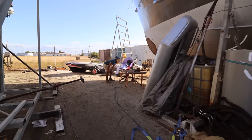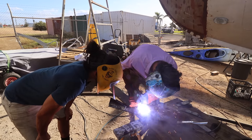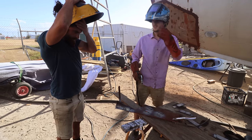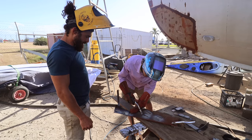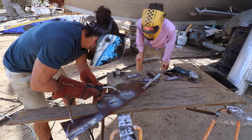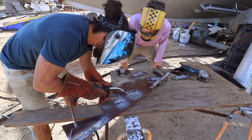Down the back, Bex is showing Carlos how to MIG weld. You really can't see much, you basically have to look at that point — did you see the puddle? The most important thing: you're basically trying to do a circle and you always want to stay in the puddle. Whatever feels better for you. Get a bit closer, and when it's doing that just grip the tip and bend the wire over the tip.